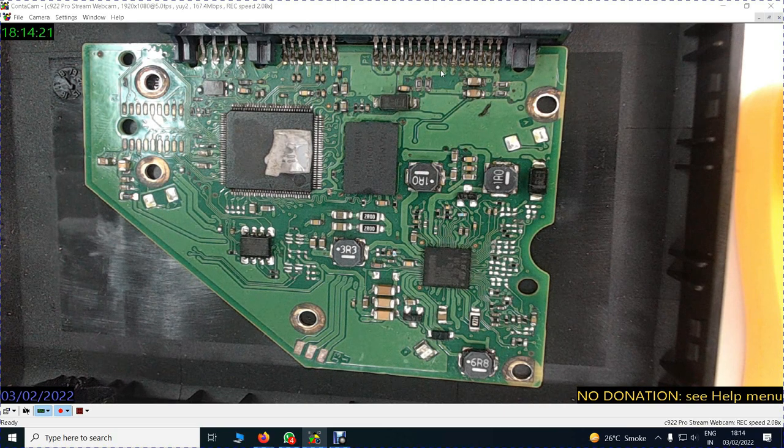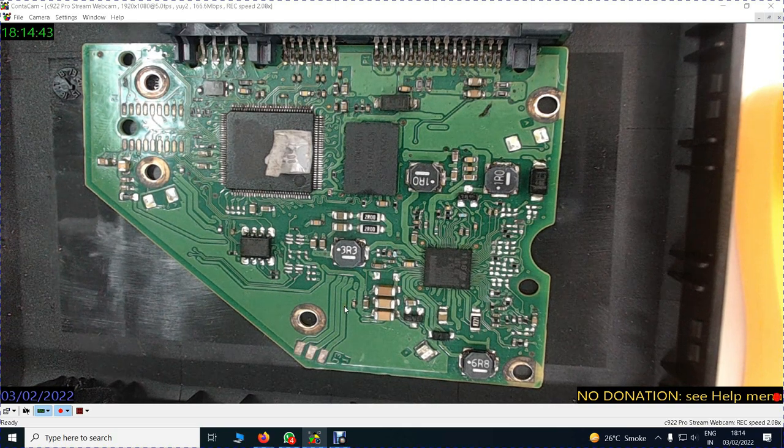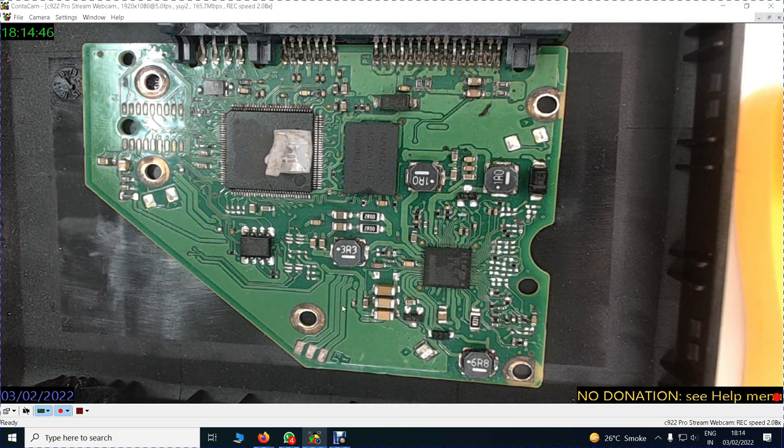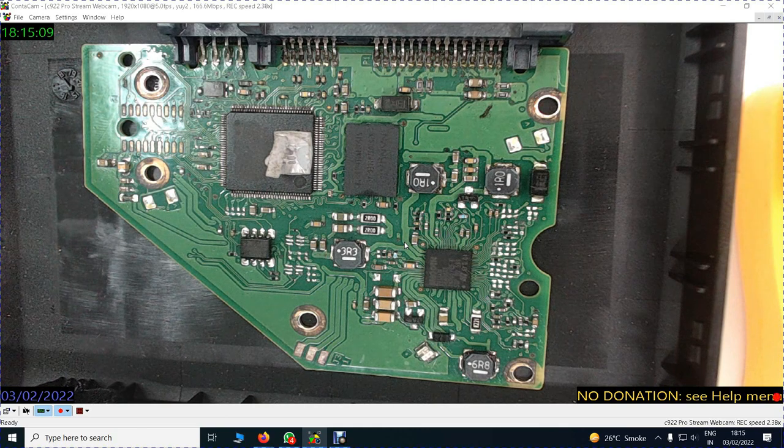Now from here you can see these are fat tracks. These are also fat tracks, but this is a fatter track than this track. So this track could be 12 volts and this track could be 5 volts. If you compare the fatness of this track, it looks a little thinner. So could it be 4.5 volts or 3.3 volts or something like that? Now you see this area, it looks like the ground, because it is a very broad track, and there are smaller tracks carrying very fine voltages there. So this was an introduction on the tracks, their size and what they mean.